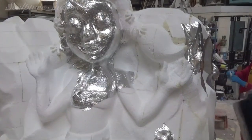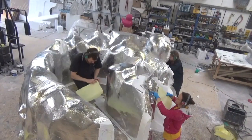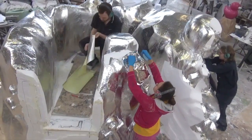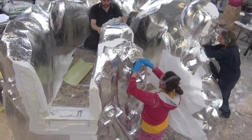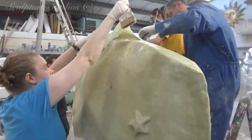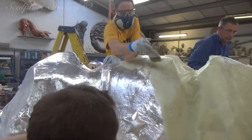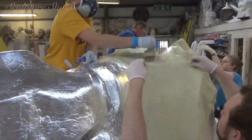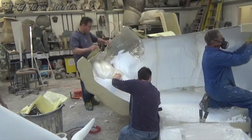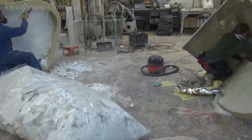Sticky-back tin foil — another favourite secret material for the fans. This provides a quick protective barrier over the foam before we go on with any glass fibre. The client has now seen the photographs and videos we've sent them, approved the master pattern, and no amendments need to be made. We're using a general purpose resin for this project. As this is going to be situated outside with water running over it, hopefully fire retardancy isn't too much of an issue. We're going over with a sturdy build up of around six ounces of glass fibre, as this will have a lot of traffic running up and sliding down it, and because we'll be removing the polystyrene from the inside to make it hollow.